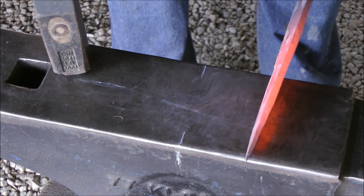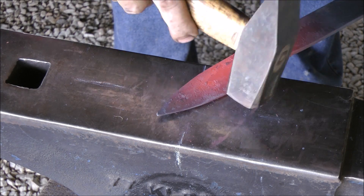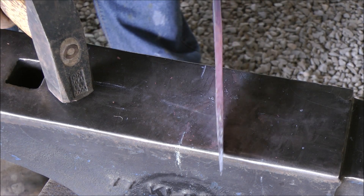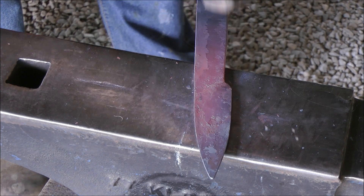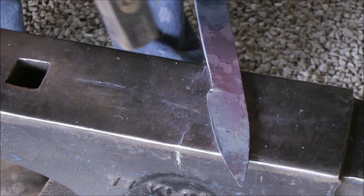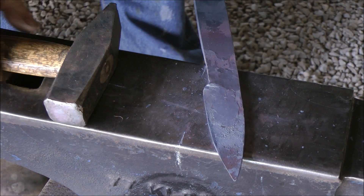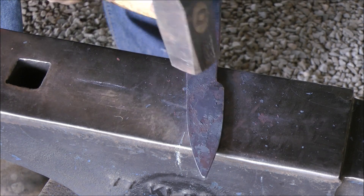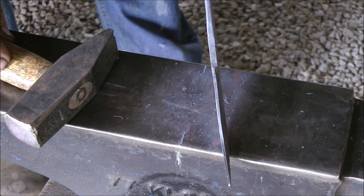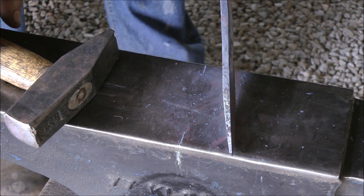The forward metal is nice and hot. I can now flatten stuff out and clean up a bit, making sure that my edge and everything else is in alignment. Keep in mind that whenever you are hammering on the ricasso area, do that very, very lightly — any and every single mark that you put in there, you will eventually need to take out again. Everything is nice and straight, the edge sits in the middle, and I love the flats I've got going there. We're happy with that.